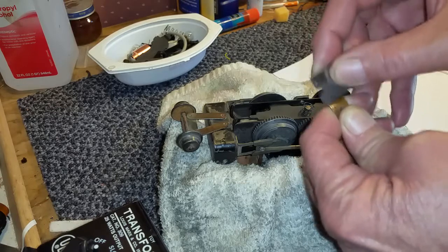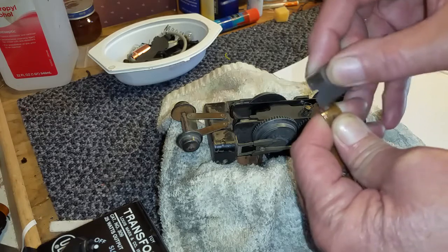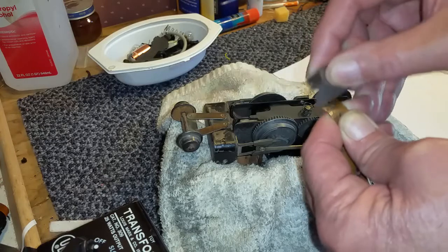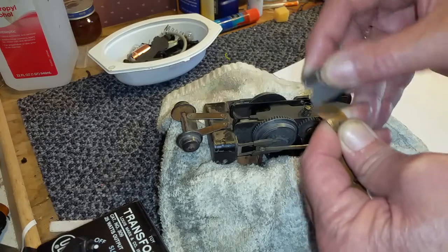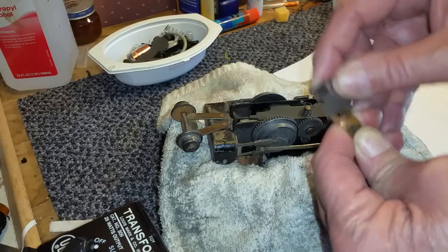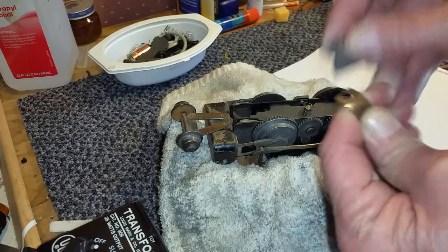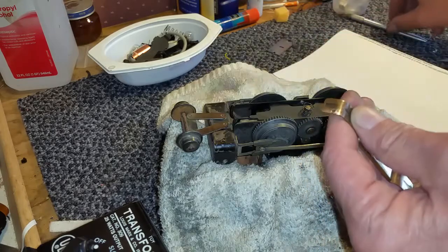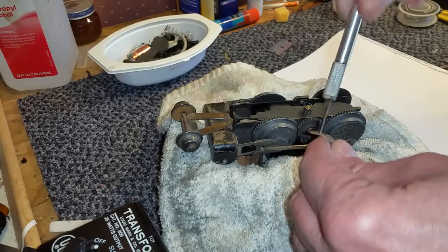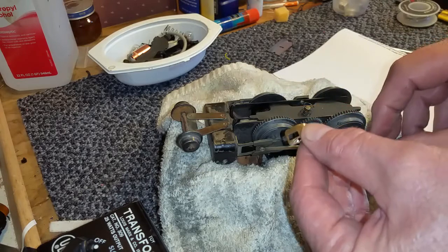It's really hard to solder to copper that's covered with oxide. Just scrape it with a razor blade, razor knife, plain old knife, sandpaper — anything. I like to use a razor blade because you can really control it and it doesn't get any grit anywhere. Take an X-Acto knife and just go around the hole on the inside. That gets the oxide off of there.